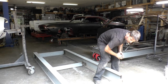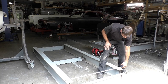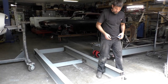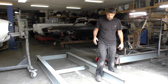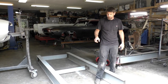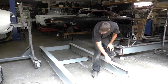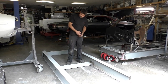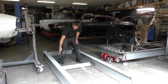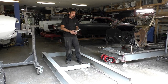We basically cut four pieces - we're four feet wide on this, so the widest part of this frame jig is going to be four feet. This frame jig is actually upside down right now. I like to build them upside down using the floor as a surface. The bottom isn't welded yet - we welded all the corners, and the center piece is cut a little bit narrower because it's cut in the middle of the I-beams. I welded right around there, so all this is solid.